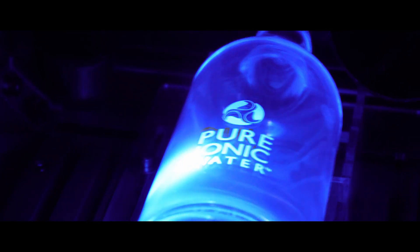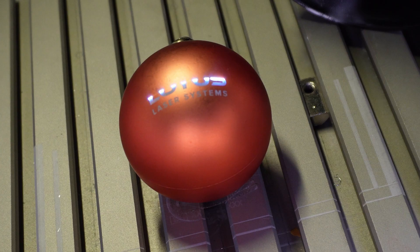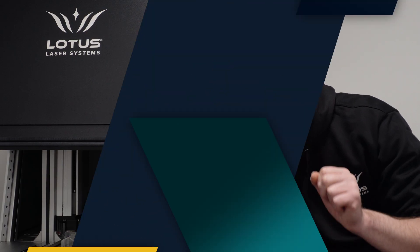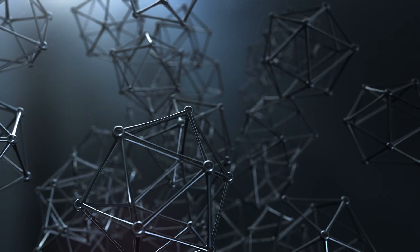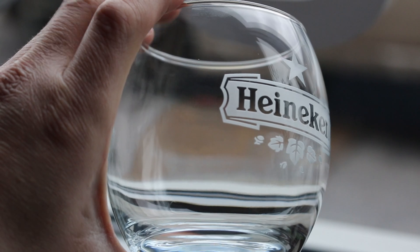We're going to kick off with UV. UV lasers are the ideal solution for marking because they use something called cold processing. The shorter 355 nanometer wavelength of UV causes it to break down the chemical bonds of the material that you're marking, a process that crucially doesn't cause it to heat up. It actually changes the material on an atomic level. UV lasers can mark almost anything, especially glass. They can even change the color of silicone without any ablation.